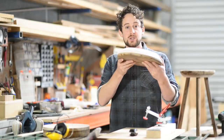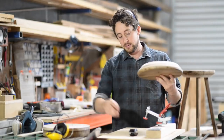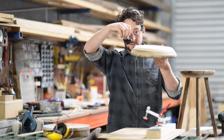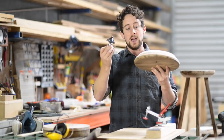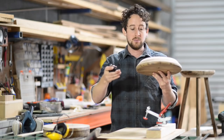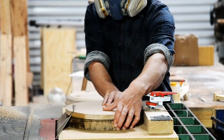I need to cut a really deep chamfer on these stools. My biggest chamfer bit for the router table doesn't even come close — it gets about halfway. There are ways you can do this in a stepped motion, but it's kind of a pain. For something this big, I'll actually turn to my table saw.